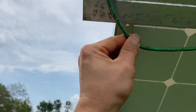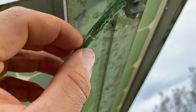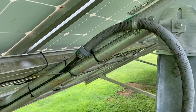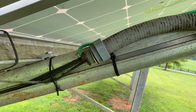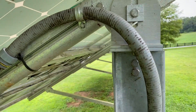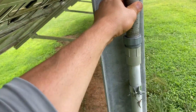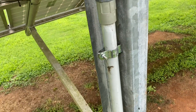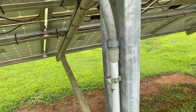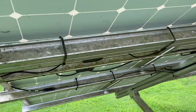The copper looks good. This is THHN run outside — it should be bare ground, but it's still holding up. The insulation on the THHN is flaking off, which is obviously why they don't want you to use THHN here; bare ground would have been fine. To get into the underground, the guy used liquid-tight conduit — regular PVC liquid-tight without the metal inside. After 10 years it looks dirty but it's still holding up. He strapped it really well, and the PVC is totally protected and supported on the north side.